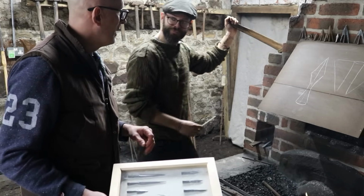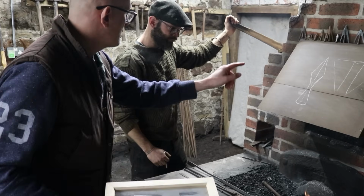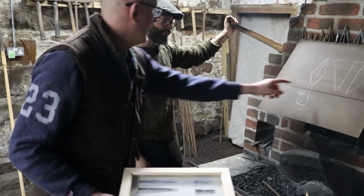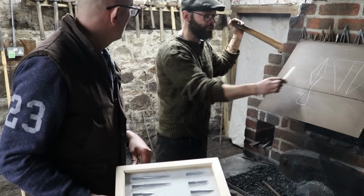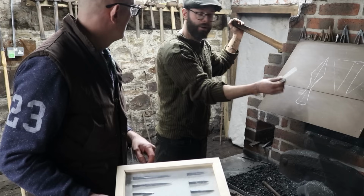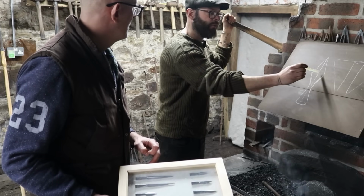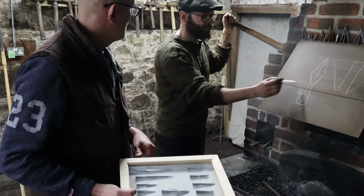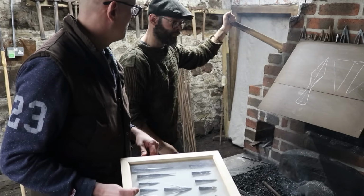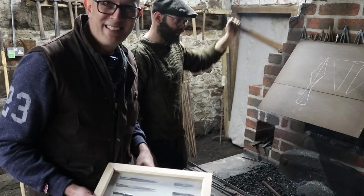Yeah, and we're starting out with a rod section of steel that has to be at least the thickness of the centre of that midrib. Yeah, so I showed you a bunch of stock that I've got, and you said none of them are quite thick enough to make this. You can't make it thicker without upsetting, which is another process. Yeah. So we have to start with over, because you're going to forge it down as well, and then grind it to shape and whatever. Cool. So it's got to be over that shape. Brilliant. Which means that that's a lot of work, but that's fine. So well, we'll see, won't we? We will, yeah. Let's go.